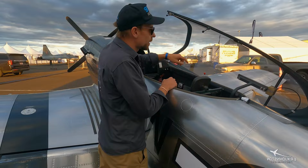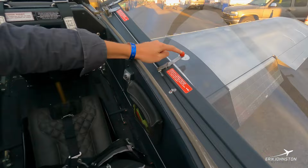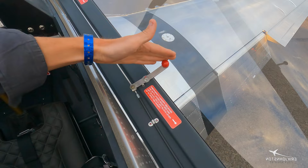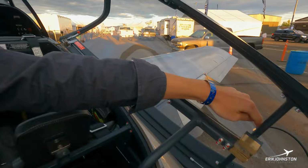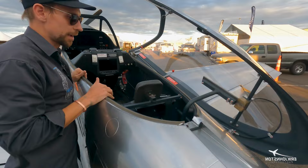And the entire canopy mechanism is very massive. It's well made. We've tested it, and it's also equipped with an emergency release function. In an emergency, where you think you better get rid of the canopy, you can pull the red lever to the back, also the black one, and then here is a pin which is going up, and then you can slide off this slider from that rail, and then the canopy gets air and flies away.